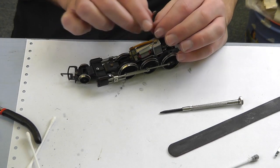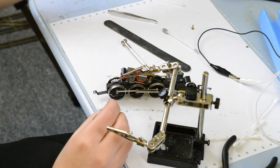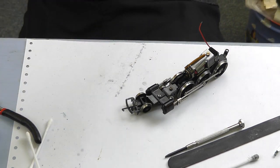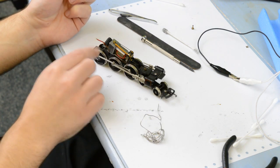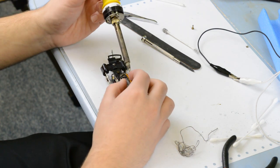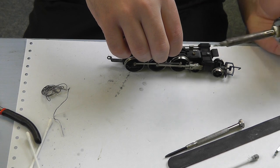Let's get the helping hand out and find the solder. I'm going to try and get this old contact off — yep, it's off. Now let's try and tin up this brush. Getting the soldering iron on there — you don't want it on for too long because you don't want to start melting the plastics. I like to keep the soldering iron on there for the shortest time possible. The wire is just a tiny bit short — no, actually that's perfect.